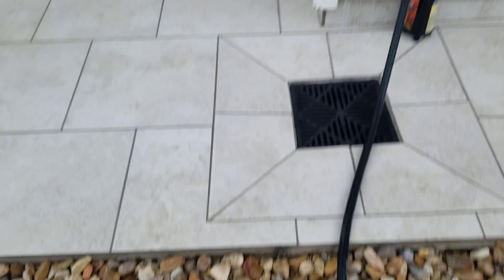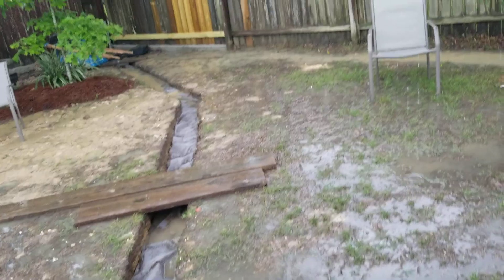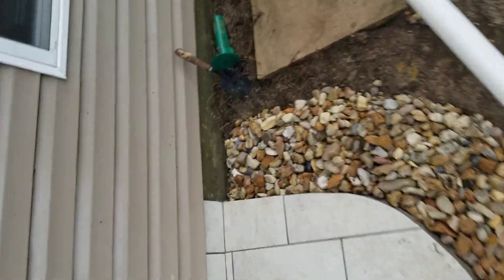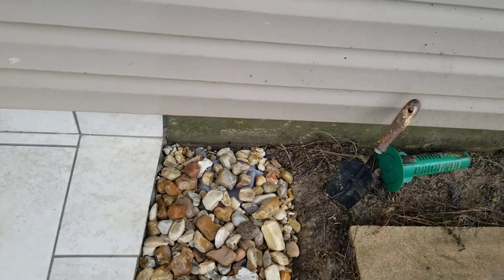All this gravel right here — underneath that is a French drain. It's not connected to that catch basin, don't let that fool you. The French drain has a tee right here on that discharge, but the French drain continues to the sump pit back there — double barrel pit. I got clean-out ports; I haven't put the tops on yet, they're buried under there with a cap on them. There's another clean-out port here which I have to bring out above grade and put a cap on.